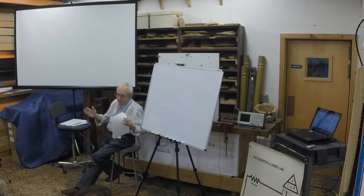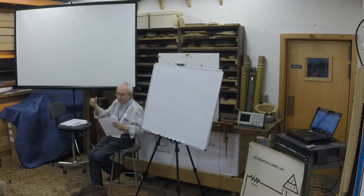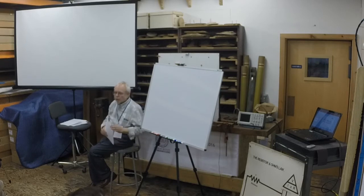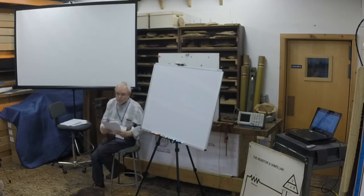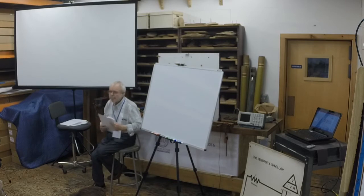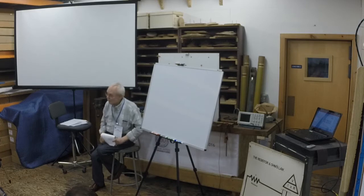If you look at an Astron, you'll find there's a fuse on the back. It's an AC fuse. It's in series with the line cord. It's the first thing the electricity encounters when it goes into that box. And after it, the next thing is the little cherry red light on the power switch that tells you it's on. Astron supplies are brute force. We'll draw some pictures here in a minute. They have voltage regulating circuits that consist of pretty shiny transistors on the side of the big ugly heat sinks that hurt your hands when you lift them. And those transistors, as we'll see later, act as valves. They control the amount of electricity coming out of the Astron. The fuse on the back is only there as a last-ditch effort to preserve the good relationship you have with your liability insurance salesman by not burning down the church.